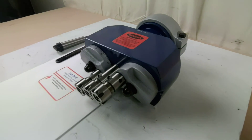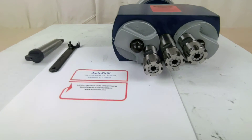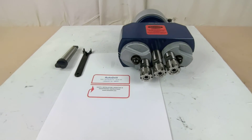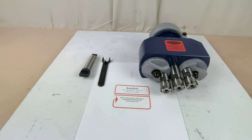Millions of holes, very low maintenance on these. 4,000 RPM maximum speed. Lots of options here — we go bigger, we go smaller. All the way up to ER-25 on the adjustables, down to ER-8. Just about half-inch center to centers. And we'll even do ER-50 and larger custom heads for fixed patterns.